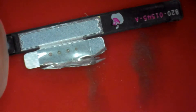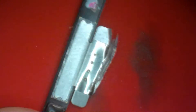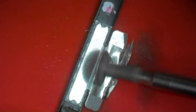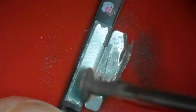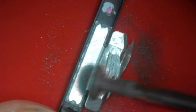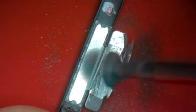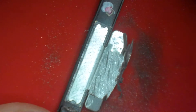Move on to the other tab — pull it up, pry it open, peel it back, and bend the tab back flat with the pad. That exposes the residual lead. We'll use the sharpening pin on about speed one or two with the flat head, using the edge to rub back and forth across the welds. The reason is to break down the welds so I can remove that residual lead — when spot welding I need a flat, clean contact surface. I brace my arm against the table to prevent the sharpening pin from shooting off, allowing about a quarter inch back-and-forth sway to grind the weld points down.